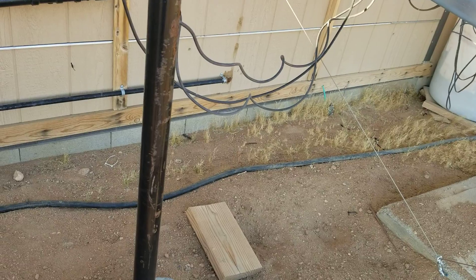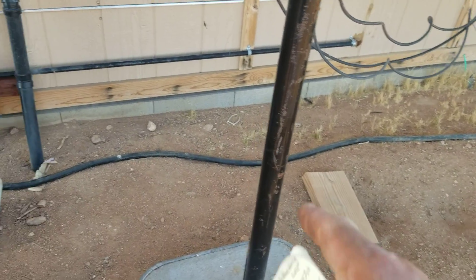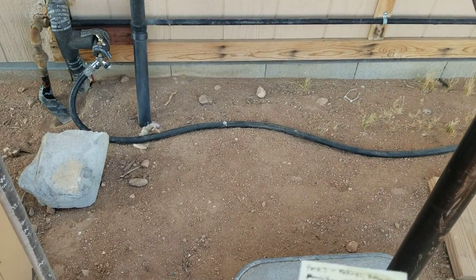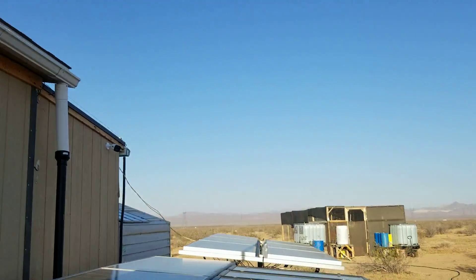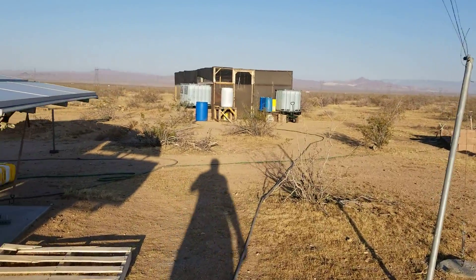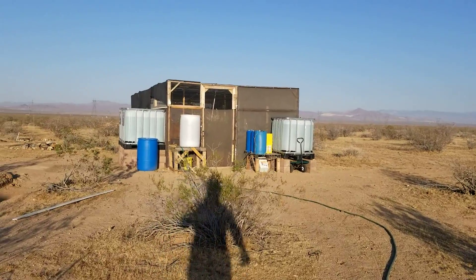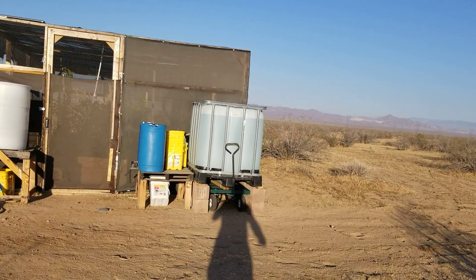That'll allow me to let this thing drop down towards me, but that thing is heavy so you don't really want to do that by yourself. What I'm going to end up doing is putting in another concrete footing up close to my building — run a really sturdy one, might even drill in and fasten it into my foundation — and then put a hand-crank boat winch down there that'll attach to this post so I can lower it down slowly and crank it back up when I need to. I'll disconnect the cable when I'm not using it so nobody can lower it and steal my PMA. I'll slip a hockey-puck lock over the eye bolt through the mast, and put a lock on the winch itself.